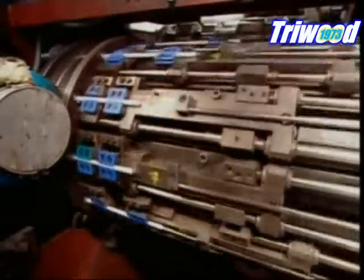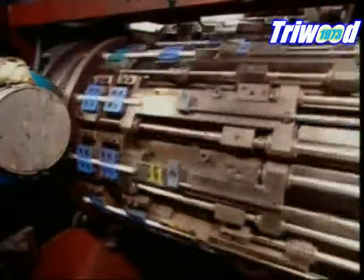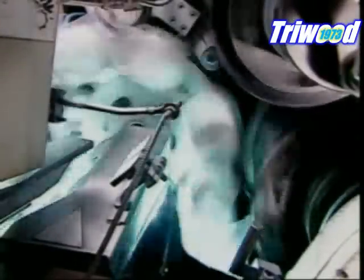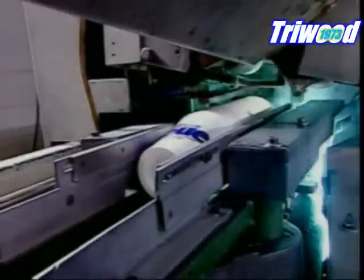The dies on this machine turn ordinary straws into flexible ones by forming a corrugated section that allows for bending at the top of the straw. The machine compresses the corrugation to preserve the shape. This factory can print customized designs in up to 6 colors applied simultaneously. Ultraviolet lamps built into the printing press dry the ink instantly.